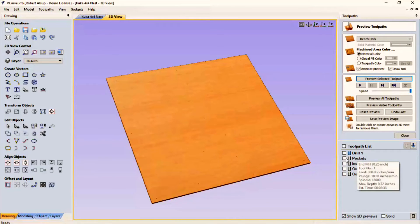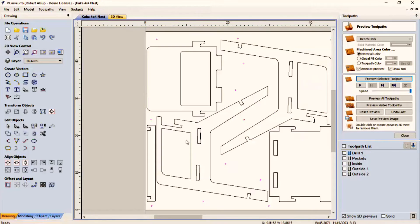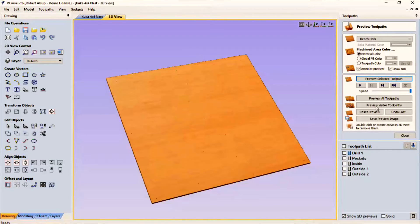Then the next thing I'll do is clear the pockets out. The pockets are basically these slots that pieces fit in — I don't want to leave any scrap in there, so I'm just going to pocket them, not cut the perimeter. So we hit the pockets, it's going to machine the pockets out, and there won't be any scrap to fly out — I cut all that into chips.